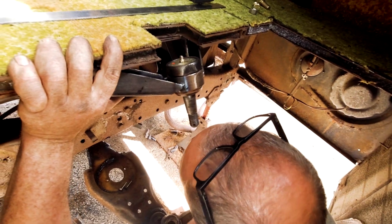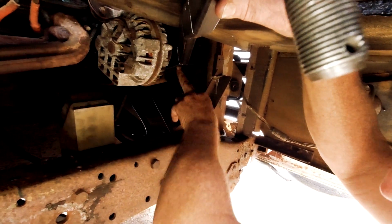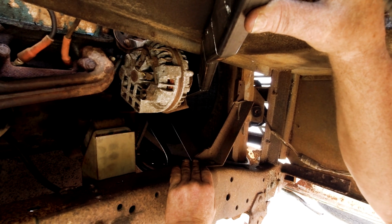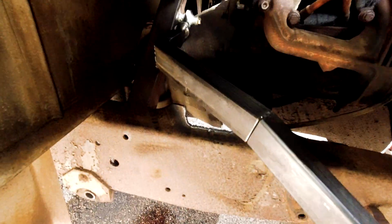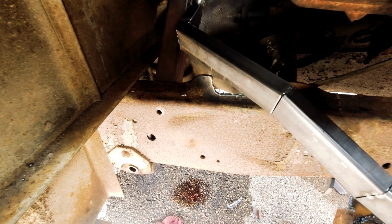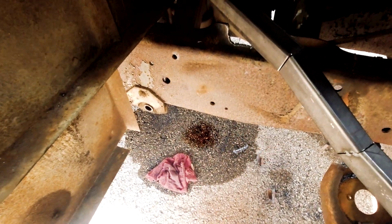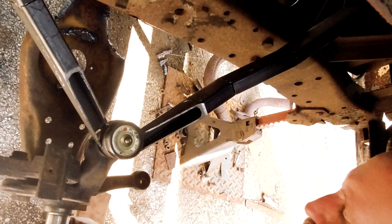Yeah, I like it. That thing fits around the alternator. Look at that alternator right there. Here's the belt. This would keep the belt from falling off. We can move that, it doesn't have to be there. Right here, it's rubbing, right where I said it would. Now I'll just torch that a little bit off. We'll just torch all of it off and then make it like a regular frame. We'll box these frame rails in so we can do that big old 3-wheel. Looking down, huh?